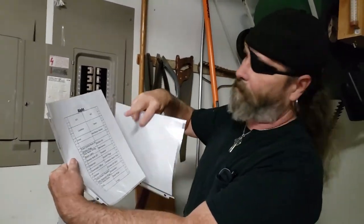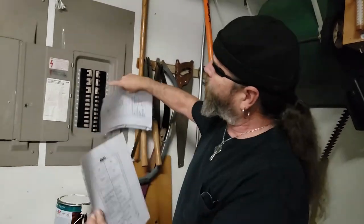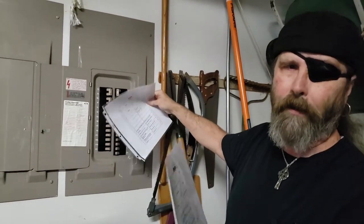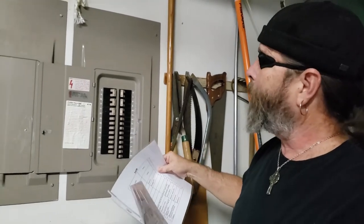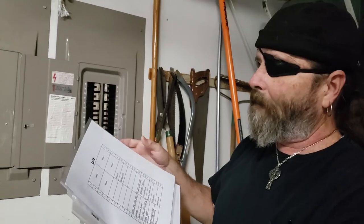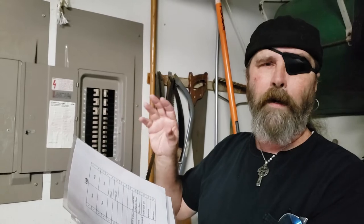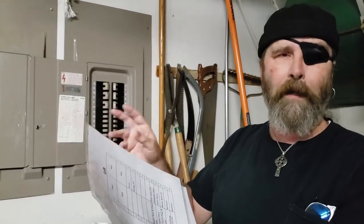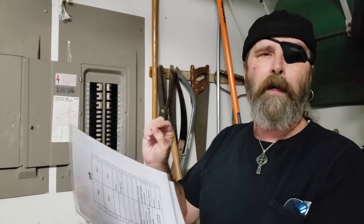When you see a big breaker where they're tied together, that's your 220. This is for your big items — your dryer, oven, heating, air conditioning, and things like that. You'll also see on some of these it'll say GFI or GFCI. GFI stands for ground fault interrupter. You're going to see that anywhere it's around water, like in bathrooms or near the kitchen sink. If you get a short — essentially any type of short — it's going to immediately pop the little breaker in the receptacle itself. There'll be a red button and a black button; if the red button's out, it means it got tripped. If you push it in and it pops right back out, something in that circuit shorted out.